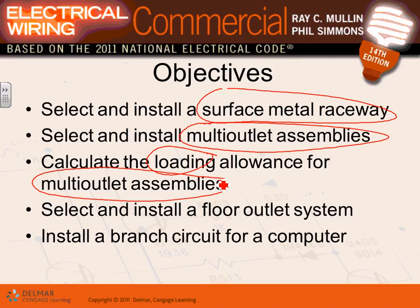I don't know if you guys remember, we said if it's used simultaneously, we put in 180 volt-amps for every foot; non-simultaneously used, for every 5 feet, we give 180 volt-amps. And so these are different wiring methods that they use in any code book. So you're looking at one wiring method here and another wiring method here. This has times two because there's metallic and non-metallic too.